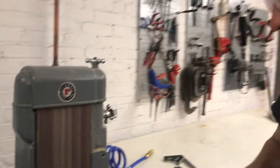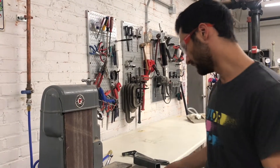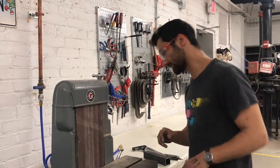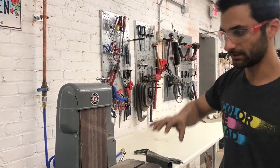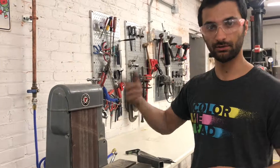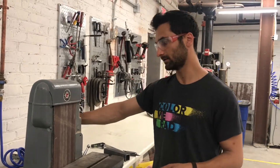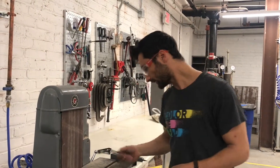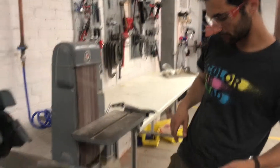We've covered using it and tilting the bed. You want to make sure there's enough tension — if there's not enough tension it'll be slipping, the belt will be stationary while the motor is still spinning. Make sure it has a good firm feeling. And again, when you're done, just make sure to push that foot pedal back so no one accidentally steps on it. You're good to go — thanks for watching.